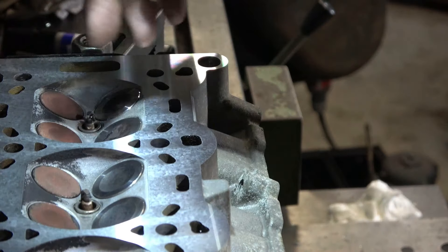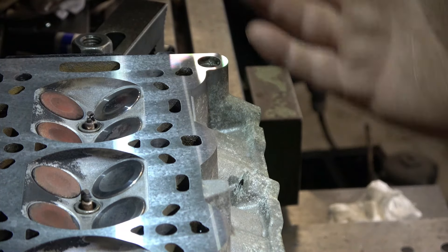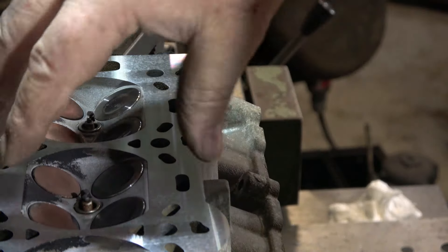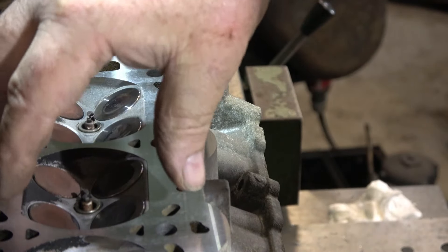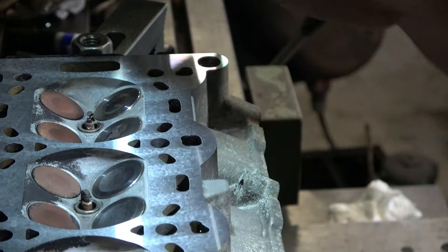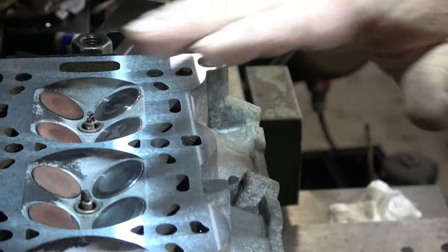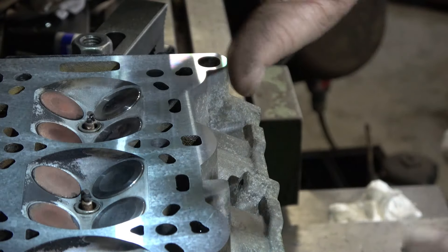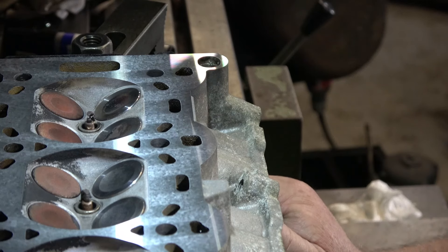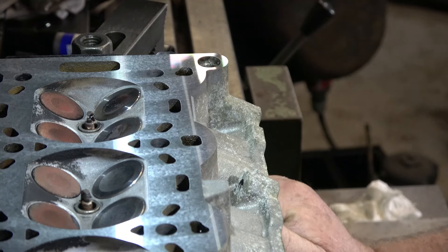This head's hollow — inside it is a water jacket, some holes for the clamps, the head studs and stuff. What happens is when this gets hot, it changes shape — it warps, and we get a hollow. It's not the whole head that warps. People go on about your camshafts won't run properly because your head's shaped like a banana — no, it's not. It's still flat.